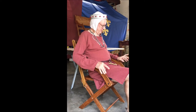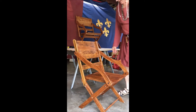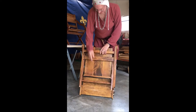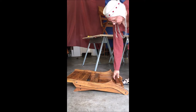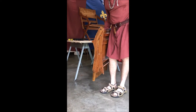The back is about an 18-degree angle off of the vertical, and that seems to be a pretty nice angle for sitting around camp, but it's not too far back where you easily slide out of the chair. I wanted to show you some of the construction tips I used to make it and also show you quickly how it folds. There's the chair folded — it doesn't have a large profile when folded up. It will pack nicely, doesn't take up much room in your car, and is easy to move around.